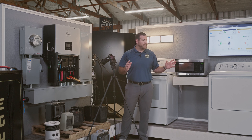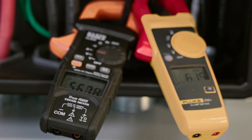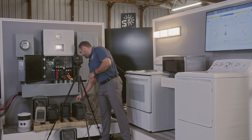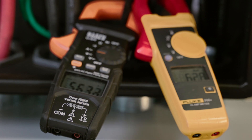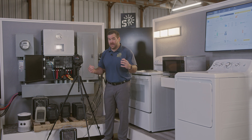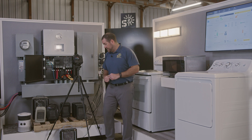So now we're over 14 kilowatts — as advertised. We're at about 61 and 56, we'll keep pushing. We're at about 14.1 to 14.2 kilowatts right now. Still pushing: 66 on one leg, 57 on the other — really getting up there, above 14 kilowatts. Let's see how many more space heaters we have to go — two more. Crank up one more.